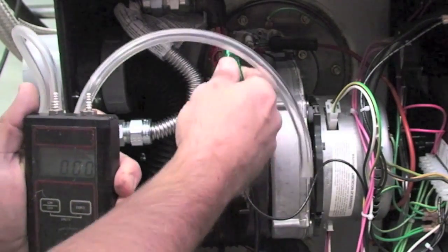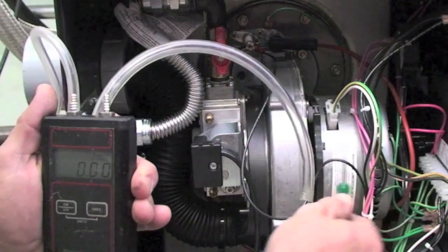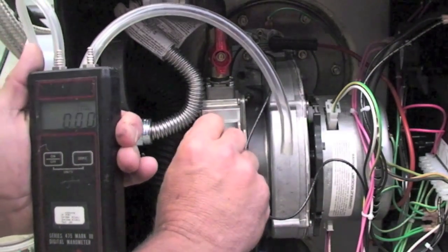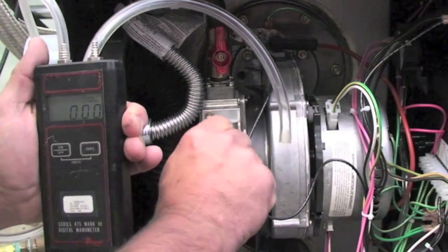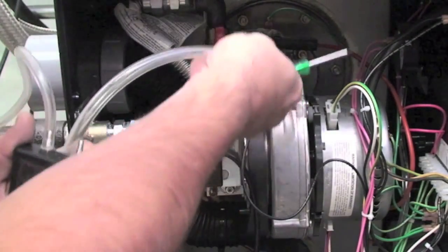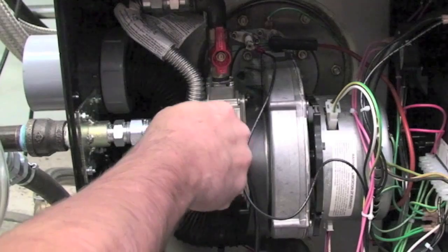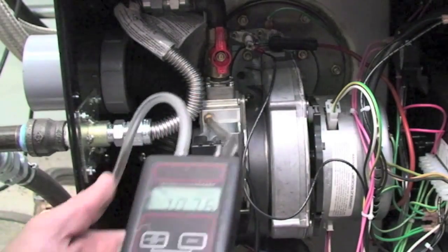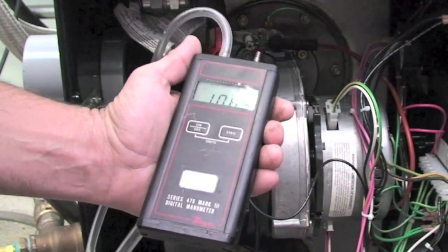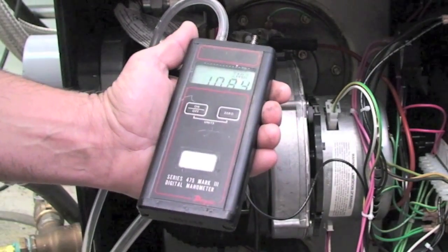Check if you have enough gas and that you are not getting a significant pressure drop in the gas line above two inches of water column when the unit goes to light off. If you experience high pressure drop, you will need to check your gas regulators and your feed piping to the appliance to assure they are sized correctly. Once corrections are made, restart the unit and monitor operation.